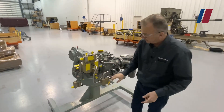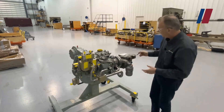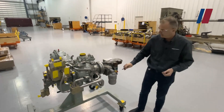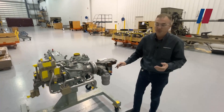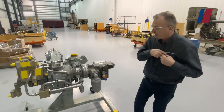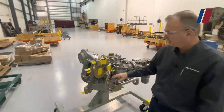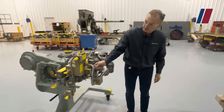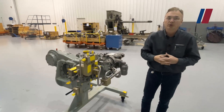This big block up here is a manifold. Your oil will come out into this mixing block and into your hydraulic pump. Your hydraulic pump has your hydraulic control unit, which drives your VSVs (variable stator vanes), your VIGV (variable inlet guide vane), and your VBVs (variable bleed doors). Your hydraulics are connected to these ports and there is also a hydraulic filter. Going back to your lube and scavenge pump, your scavenge line comes out from this port back to your lube and scavenge filters, then to your cooler, and back to the tank.